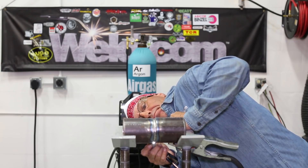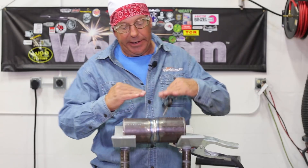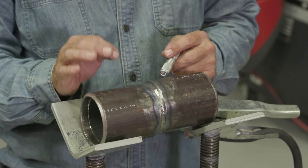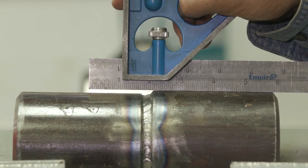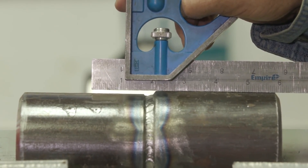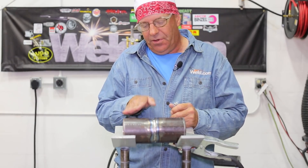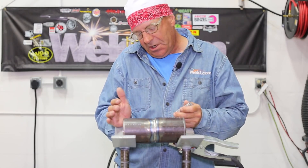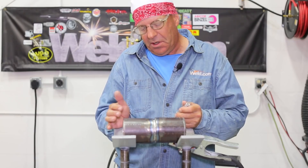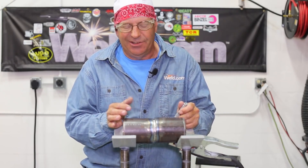This is kind of how it's expected to be — it's strange because your bead is laying in there at an angle. We've got some good B-roll. This is almost out of tolerance. Looking at the bead on the inside, at one point it's like you're taking a picture of it and you can't really see the bead because it's laid in there at an angle. But the important thing is the edges are fused and it has reinforcement — it's not sunk in. I could have gone at this with some 1/8-inch wire with this fit, although I would have been a little more nervous about that melt and that edge without getting too much profile in there.